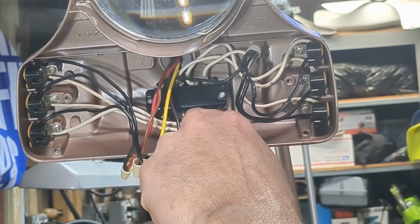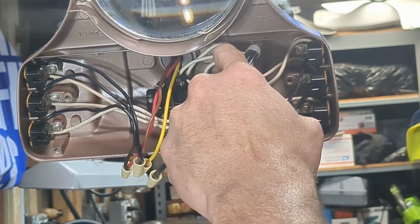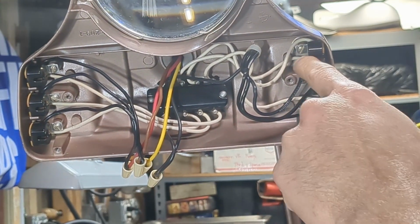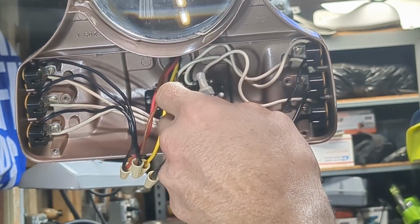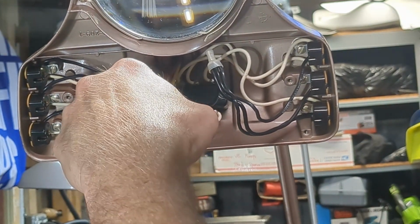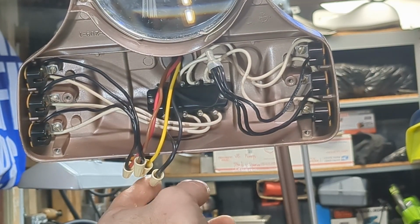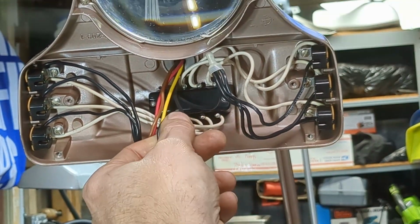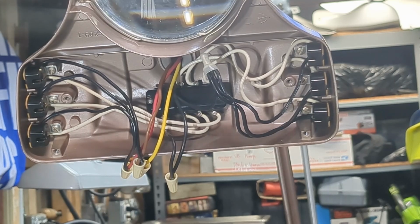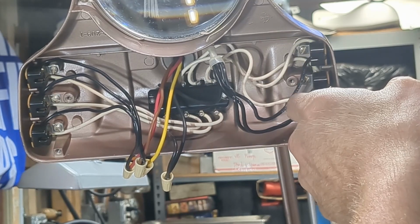So these 3 wires come here from this side, go up through and connect to the tombstones on the other side. And finally, these black wires all come back together, connect to the on-off switch part of the switch, the non-fluorescent warm-up part, and then they head back down to the base. So in our case, we don't need all this stuff. We don't need this side other than the tombstones.